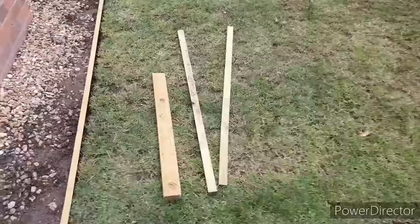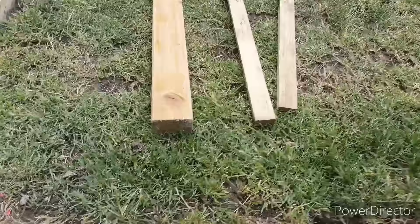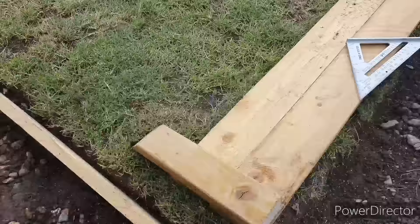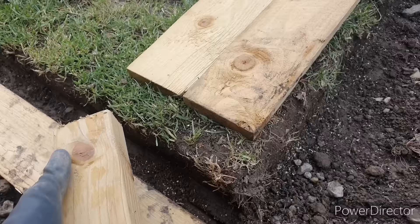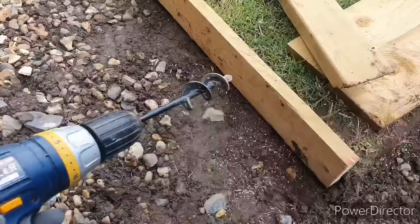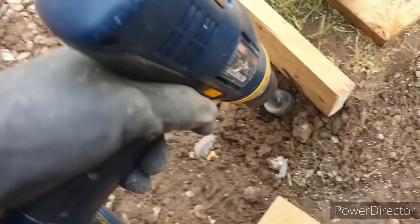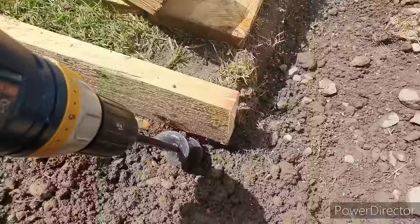In terms of the posts, I'm going to be using 4x2 and I'm going to cut the depth of the posts between two and three times the length of the board. Putting a slight angle on the bottom of the peg makes it a little bit easier to knock in and it also forces the peg to leverage up against the board and onto the surface. The easiest way I've found to produce the holes is to use a bulb auger — I've linked the one I'm using in the description below. It's the easiest method: just drill down with the auger and then knock the posts in with a sacrificial piece of wood.